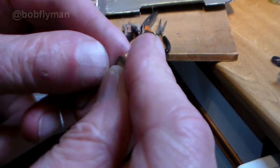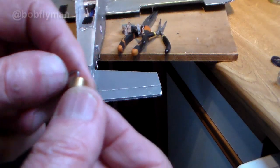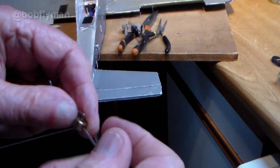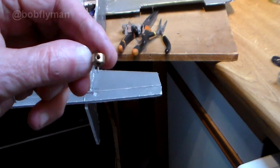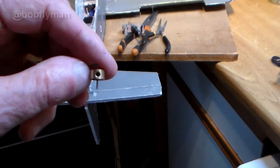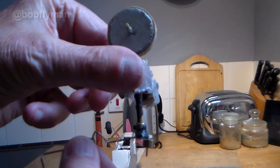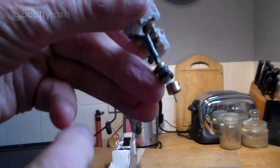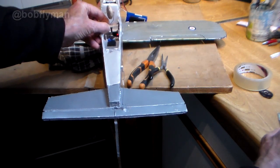That's the little thing that's going to lock this onto the servo arm underneath - just one of those things you put on an undercarriage to keep a wheel on. So that locks on there nicely and holds it in place. It's much easier to do this now before gluing it in, and I can make that final adjustment for position at the gluing stage, having centered the rudder servo.